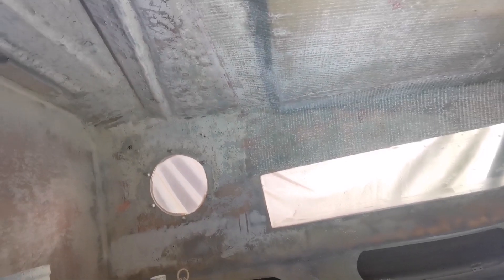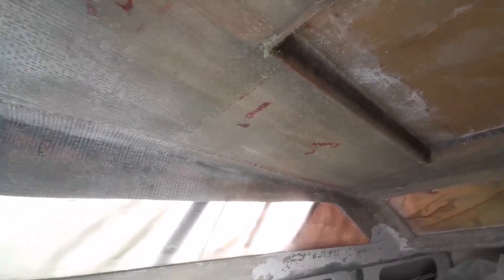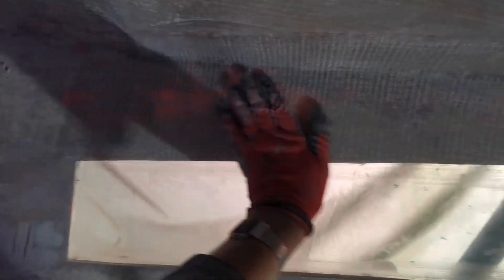I've got a lot of sanding to do. I'm not filming it all, but basically I glassed the underside of the deck in and once again I never got to finish it with gel coat, so I've now got to sand the glass, which is something I didn't want to do. If I had put a layer of gel coat on there, that would have acted like a filler and I could have sanded that, but I didn't because I ran out of time — it took me a lot longer than anticipated to get it all up.